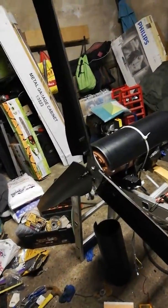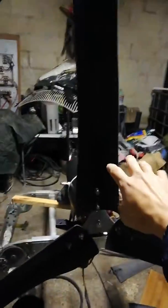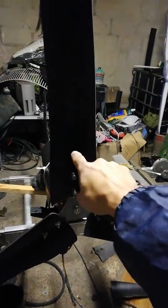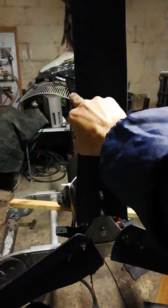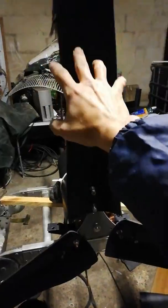I cut them with my angle grinder so they are not very balanced. I think I made a mistake — we all make mistakes in DIY projects — the trailing edge, which is the sharp side: I think by mistake I sharpened this side on all the blades rather than the other side. Because the treadmill motor is clockwise, I think the sharp side should be on the leading side cutting the wind, and the thick side on the other, but I'm not sure.